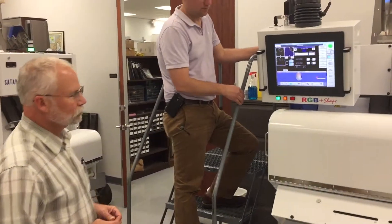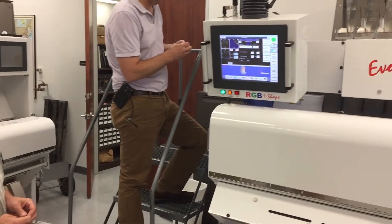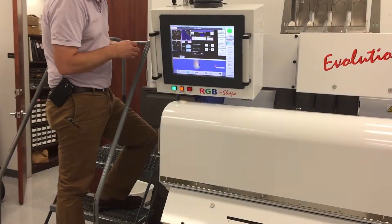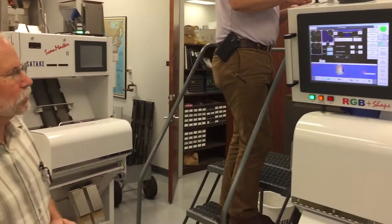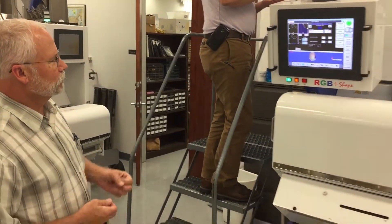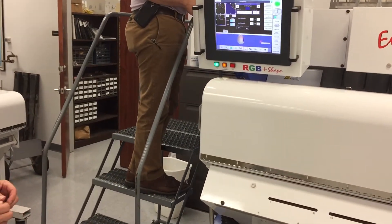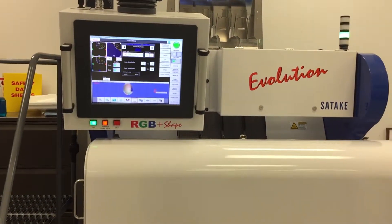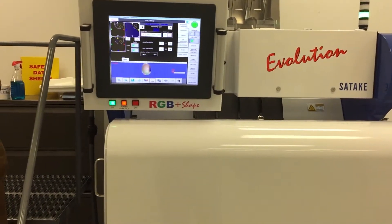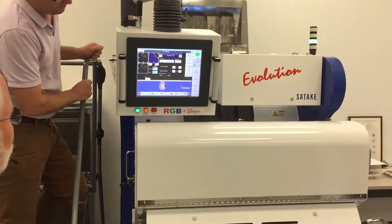There's currently a lot of interest in sorting the dark hilums out of the clear hilum soybeans in the edible food industry, and it's something that we can definitely see with the evolution technology — we can pinpoint that dark hilum, even the lighter browns and the smaller hilums. The issue becomes orientation: as the soybean goes down, we have cameras looking at it from both sides, and if it happens to come down facing one of the cameras we easily take it out, but if it goes off to the side then we're not able to see it.